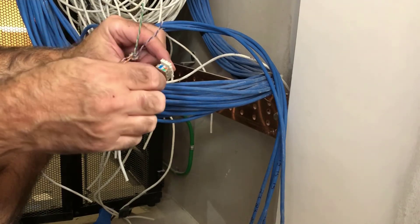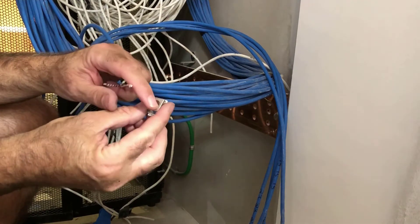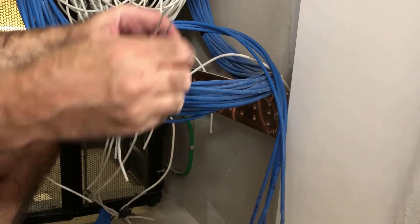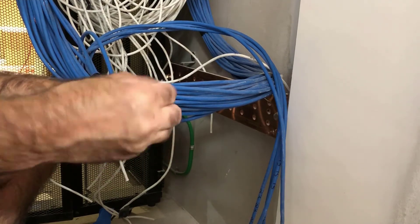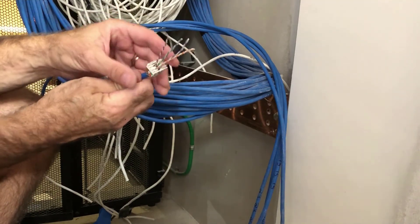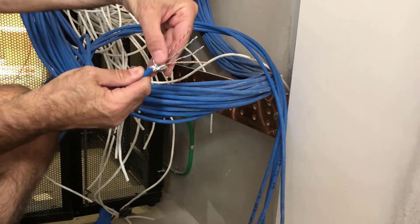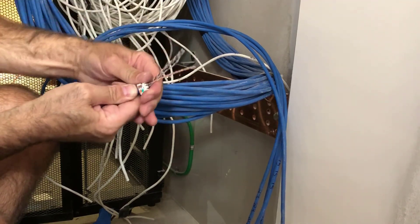You want to line the colored wires up with the color code on the rear housing. Next, insert the prepped cable through the rear housing and wiggle it until it snaps down into a secure place so the foil contacts the metal housing.